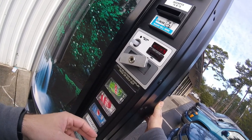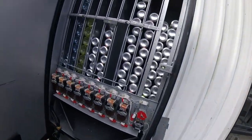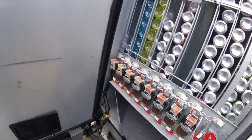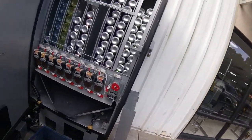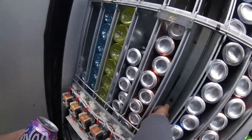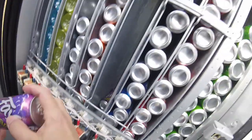Now we're seeing JC4 and JC10 — JC4 means jam column 4, which is what we're working on right now. It's going to home back into place once I press some buttons — there it goes, it's homing. Now it should be good to go, so I can load the grape sodas back into column 4. Column 4 should be clear at this point, so we should no longer get that JC4 error.